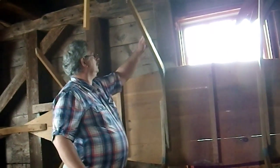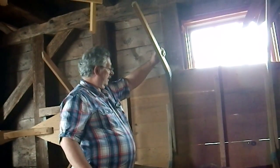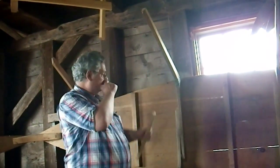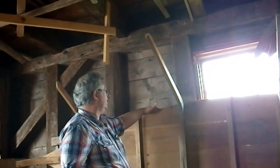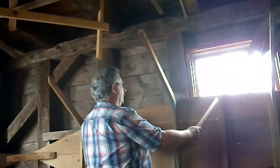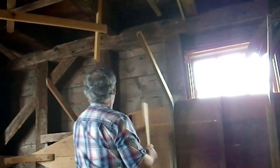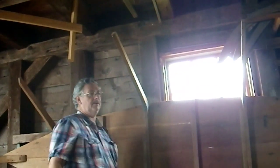And you do this before you put it on the jig? Yes, you do. You assemble the boat just the way she is right here. And that pencil line there, you would line up the ribs right to the pencil line, then you would nail them on from underneath. Everything's done from underneath. Then you would bevel the bottom to the rake of each one of these ribs. From here to here, the bottom would have this bevel. From here to the stern, it would have this bevel, and so forth.